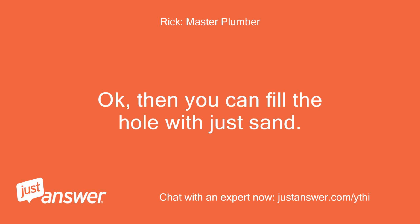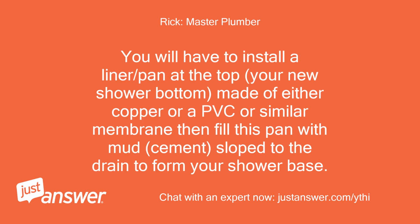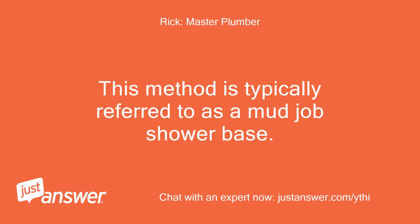Okay, then you can fill the hole with just sand. There's no need for cement powder. You will have to install a liner slash pan at the top, your new shower bottom, made of either copper or a PVC or similar membrane, then fill this pan with mud, cement, slope to the drain to form your shower base. This method is typically referred to as a mud job shower base.